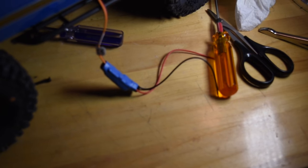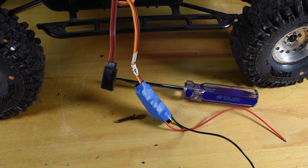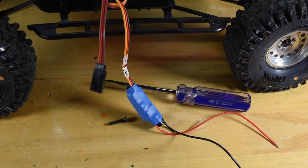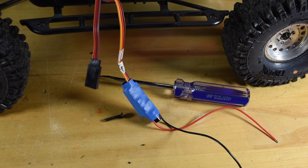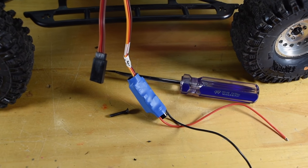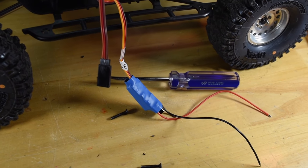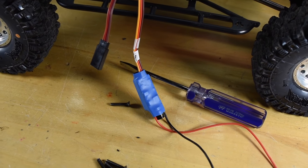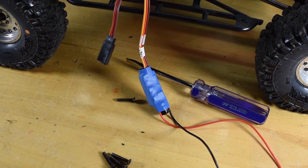Time to get the BEC hooked up. There have been a lot of videos about BECs so I'm not going to go into too much detail, but it's a battery eliminator circuit — it basically ensures that I get power to the receiver when I need it for the servo. I'm running lights now, not that they're drawing a ton of power, but still. If I ever want to upgrade to a more powerful servo, I can do that without worrying about it cutting out or browning out. But actually, I have a baby awake so this is going to have to wait.